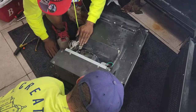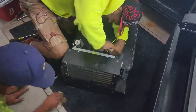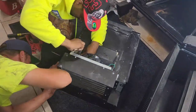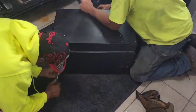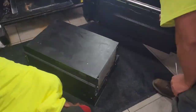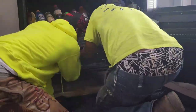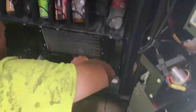Clean up any mess you made. Put your pan back down. Put the evaporator coils back down. Put all your screws back in place and set the refrigeration unit back in the machine. Once you've done this, you've saved yourself a couple hundred dollars — you've unclogged your drain hose yourself and didn't have to call anybody out. I appreciate the time y'all gave us for watching and supporting the video. I'm going to be dropping more for y'all entrepreneurs who got machines and problems you're running into. Appreciate y'all for watching, and I'll see y'all next time.